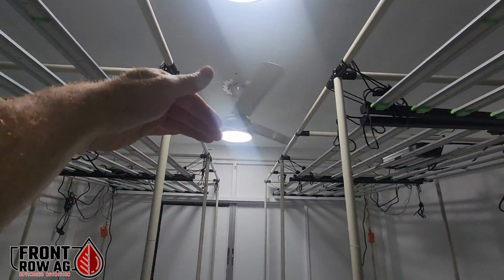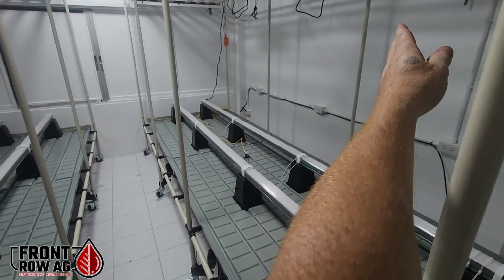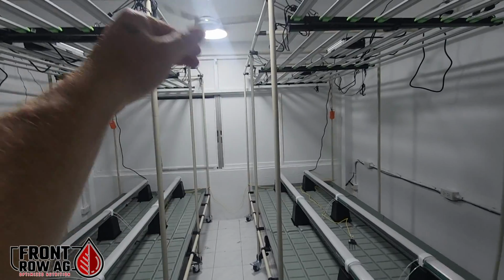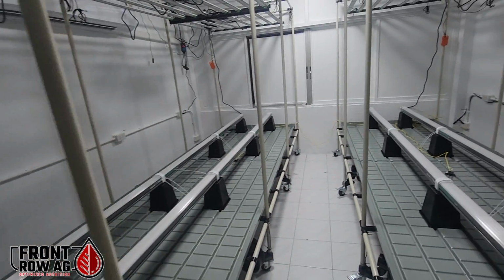Because our ceiling fan pushes the air down, I want the air to go like this in the room, under, around the walls, and then back up. So it'll be a nice vortex around the room like a donut.